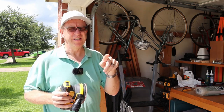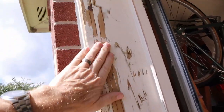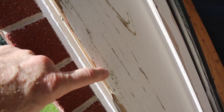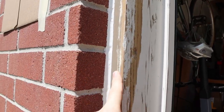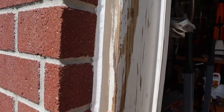I'm going to paint the areas that need to be caulked, primer them and then paint them, then come back, caulk them, and primer all of it and paint it as one final coat. I've already started sanding up here. That gouge right there — I've taken the caulking out and I'll sand and redo it. Right in here it kind of looks like it's black and showing through. And when you feel it, it's still kind of rough, so this time I'll smooth that up a lot better.